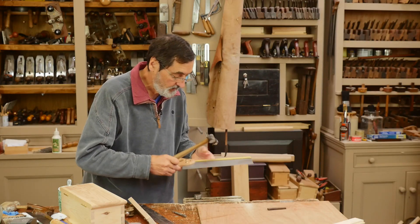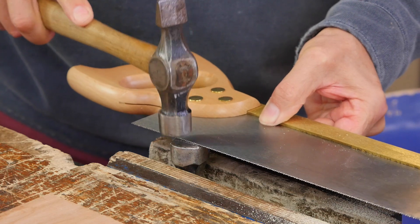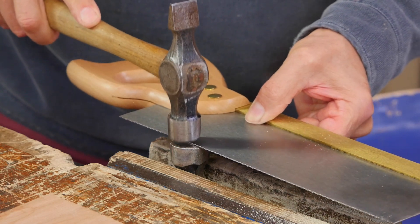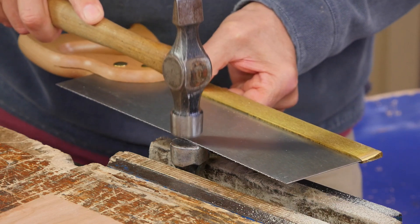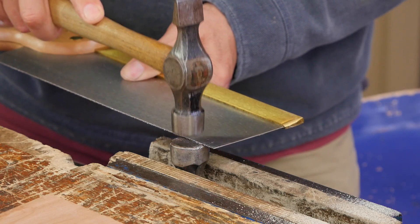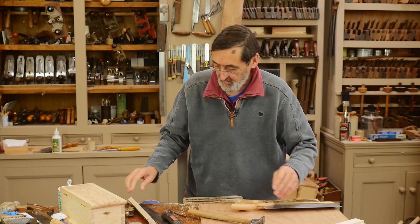Remember safety — you have to take care of yourself. Flip over and do the same from this side. What's stopping the hammer is the plate itself, but the memory of the steel means the tooth is springing back because it does have spring in this steel. Work all the way along — wear some safety glasses just in case. You're not striking that very hard.